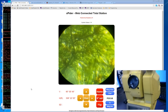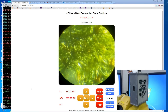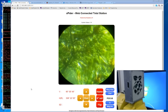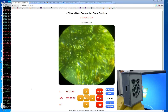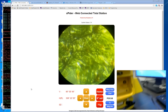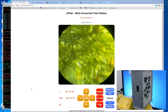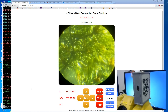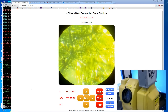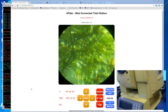Inside the little housing there's a lot going on. We have a custom-built 5-volt 2-amp switching power supply which connects to the micro USB powering the Raspberry Pi. We had to make sure the power came directly from the battery or external power supply, because we didn't want to pull from regulated power inside the total station that wasn't able to supply the current we needed. So we had to hack into the total station — which is not recommended, as these units are no longer under warranty.